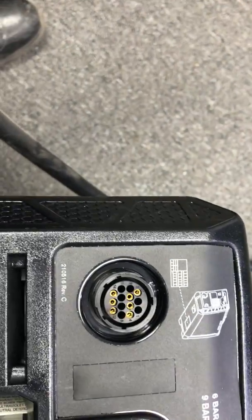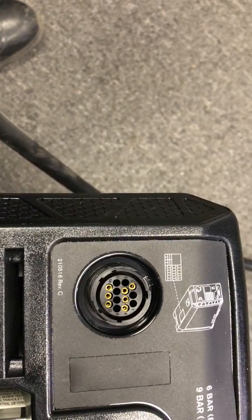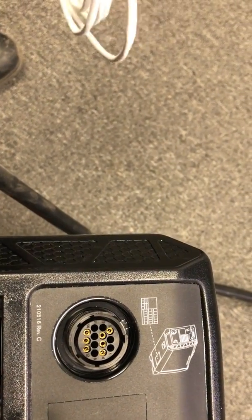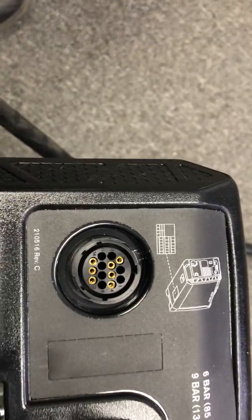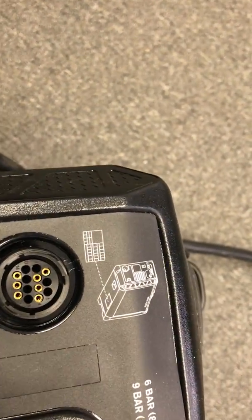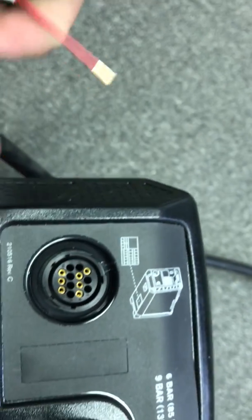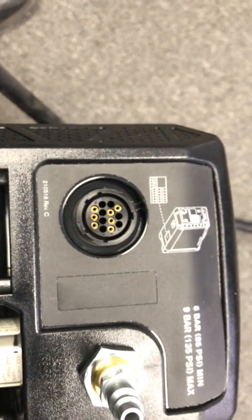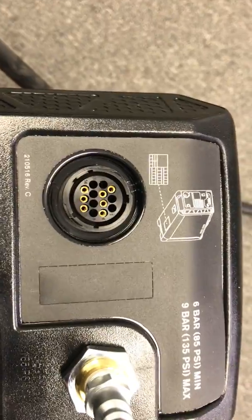Because we offer so many integrations — you can hook up our system to almost any plasma cutter in the world — we can't necessarily provide a CPC port that matches every design. While this could be a 14-port design, there are a lot of 12-port designs and so on, down to even 4-port designs. So what we do is provide you with these two extended leads. We do provide in certain cases some Everlast and some Hypertherm CPC ports, but because of the cost to acquire those parts and how they can tend to be cost-prohibitive just to include them in the price of the machine.